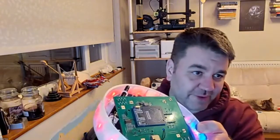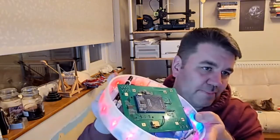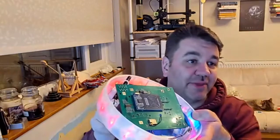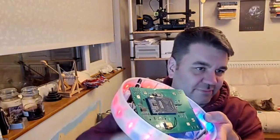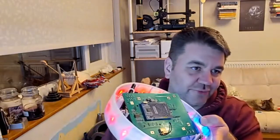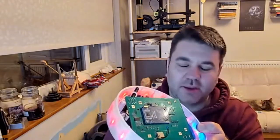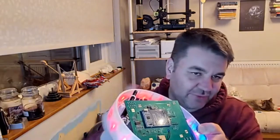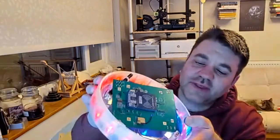I can't use 3.3 volts as the comparator, because the actual battery could drop below 3.3, and then all I see is 3.3 volts, because the value won't change from there. So that's the reason why you have to use a different internal reference that's lower. So that's the main board.